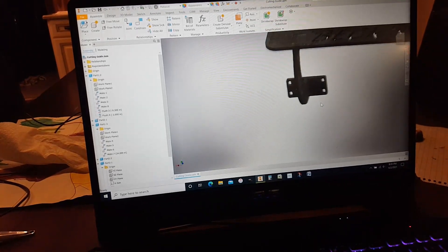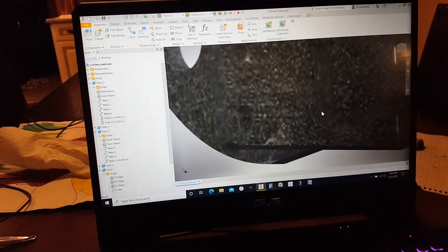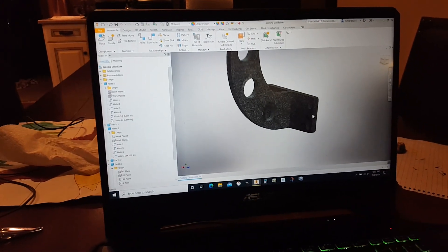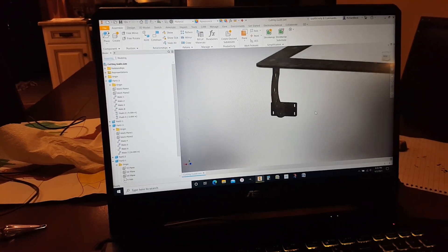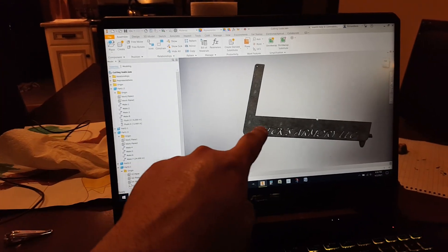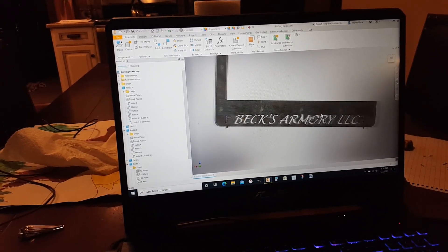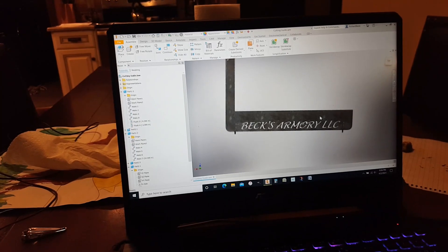Relieve the corners — that's the strategy I did down here as well. You can see all the tabs are relieved like that. I made these one and a half inches because it's two by two tubing and I want them to be adjustable, so I've got slots sized for 10-24 or 10-32 hardware. This is going to hang into the actual cut area, and I'm going to set my plasma cutter to zero-zero, do a straight line cut on the bottom and a straight line cut at the top. When you put a piece of material up against this edge, it will be an actual zero, so I'll be able to throw parts on there and index them quickly.